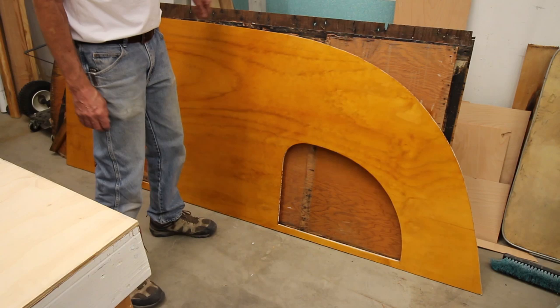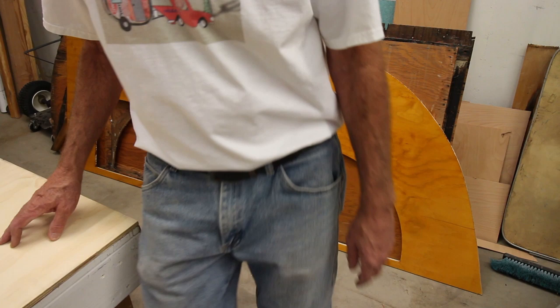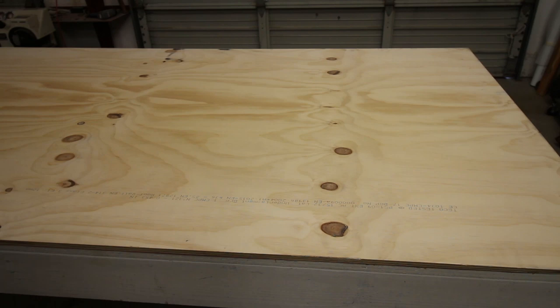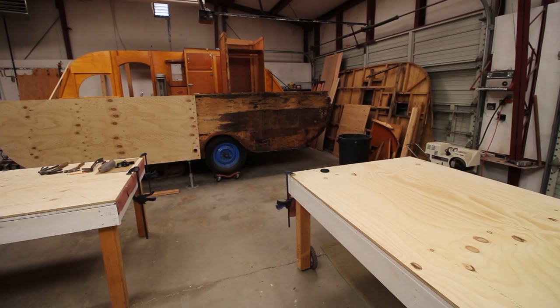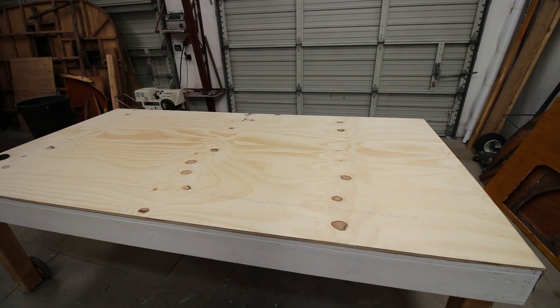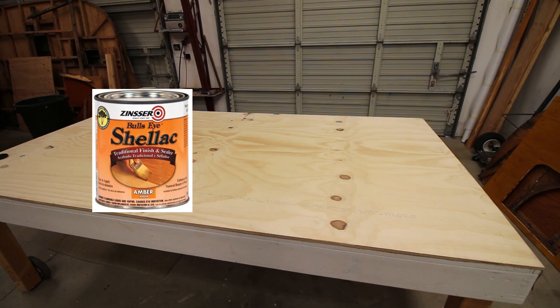What you see behind here is all the old stuff that we've already made copies of, so this piece is just waiting for me to get the other two pieces done and then we can assemble it all. Over here I just put down the next piece of plywood to be traced — this is the piece I'll make that lower portion out of. I've got to take that off, lay it on top, trace it, and cut it from the back side, then flip it over, sand it, and shellac it. This trailer is getting six coats of shellac total — four coats of amber and two coats of clear on every piece.